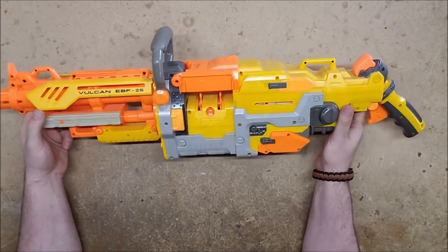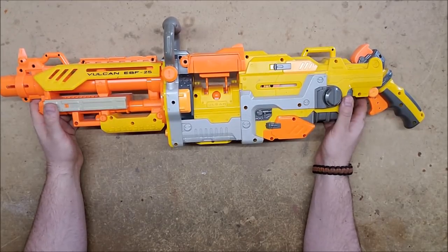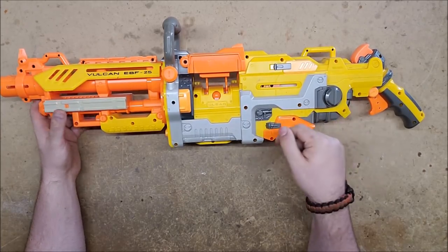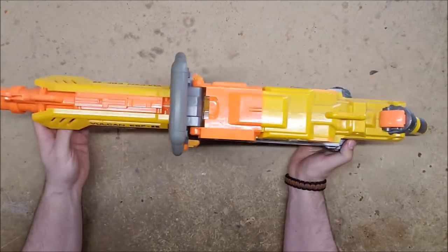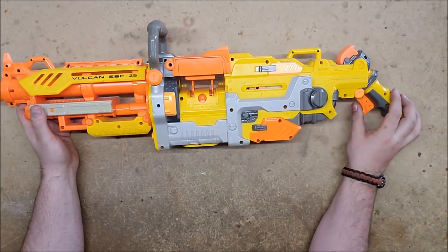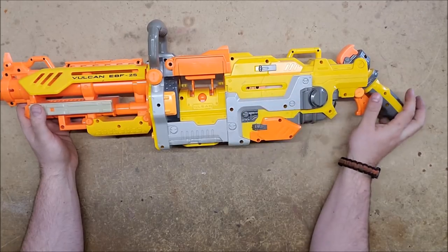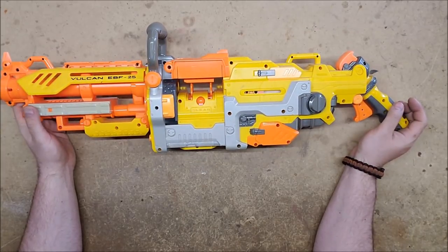It is going to have all of the original wiring completely replaced because it's going to be running off of the 12-volt battery that the wheelchair runs off of, so I may end up actually doing a spring upgrade. We will see. For now, I'm just going to wire it directly to a jack that they can then wire the wheelchair into, because the wheelchair will have a joystick that allows him to aim the gun, as well as fire the blaster. So the original trigger will do nothing at all. It'll just have negative and positive coming in from the chair, and the switch will be in the chair. So there won't actually be a firing switch in the blaster. And then everything else is going to get gutted and painted, and it should be truly, truly epic.